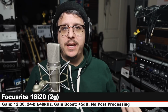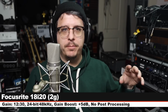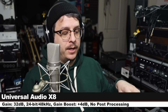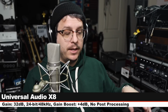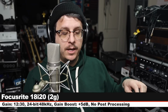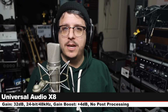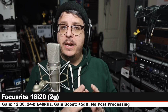Now, in order to see how this microphone will perform running through a better interface with better preamps and better analog to digital converters, I'm running the mic into a mic splitter. I'm running one of the outputs to the Focusrite 18i20 and the second output to the Universal Audio X8. The Focusrite is set at 12:30. The gain on the X8 is set at 32 decibels, both recording 24-bit 48 kilohertz, and I've level matched them